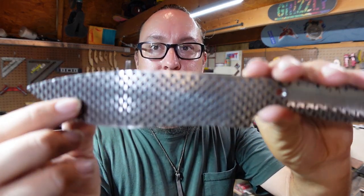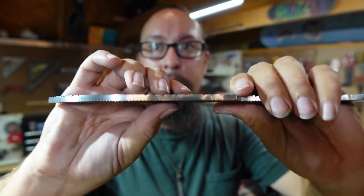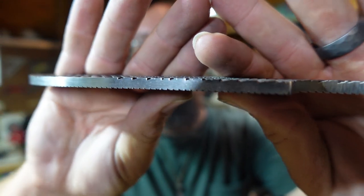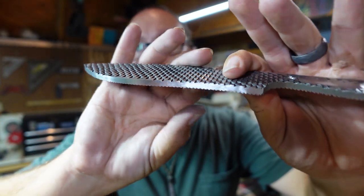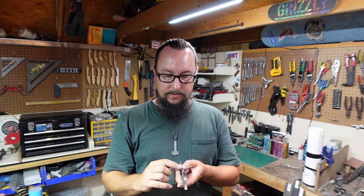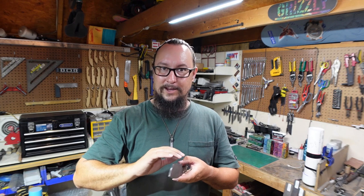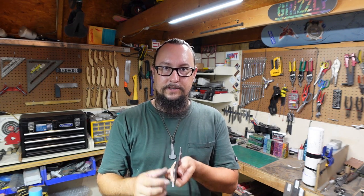We've got all of the triangles on this side, all the lines on this side. What that ends up doing is leaving a bunch of little indentions all the way down the edge here, which really aren't going to matter when it's all said and done — when we start bringing the bevels into the cutting edge we're going to get rid of all those little notches. But whenever you go to start trying to mark your center line you can't use your calipers to run down this, so you've got to do something a little bit different.